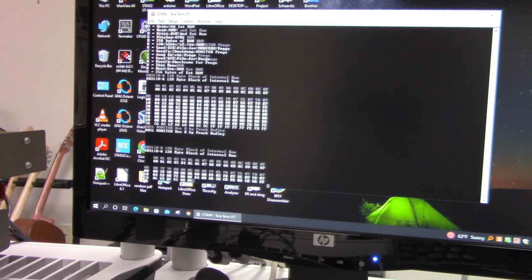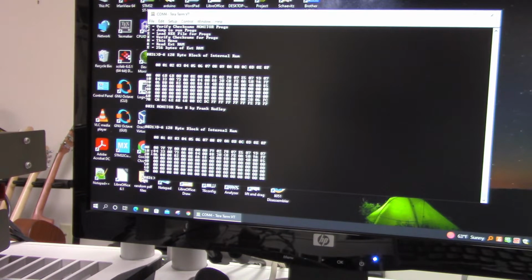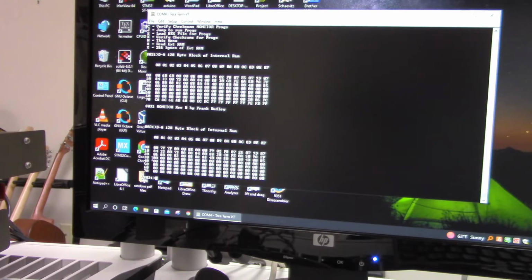It runs very quickly. So now if I look at this area, it's from location 30 to 7F. It's all zero now. So this is where the registers are located, and there's bit logic, but usually from location 30 to 7F, that's usually good for scratch pad RAM. So just wanted to show you the setup there.